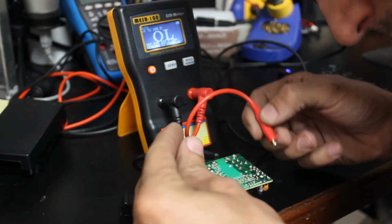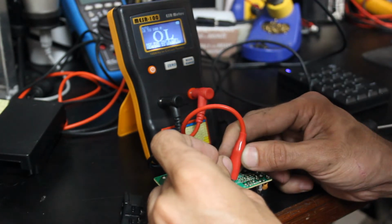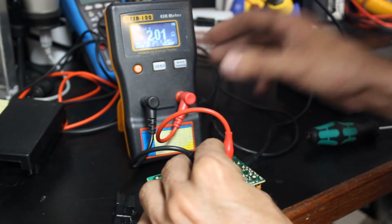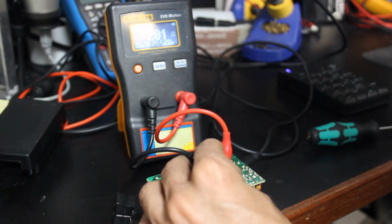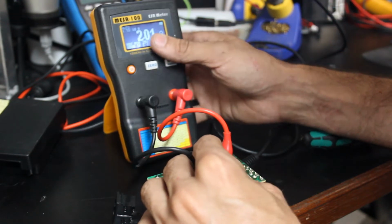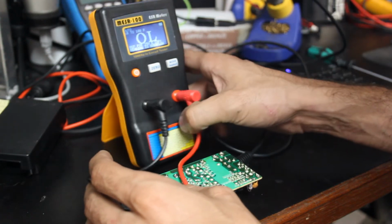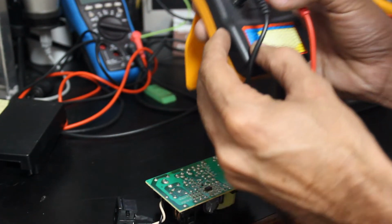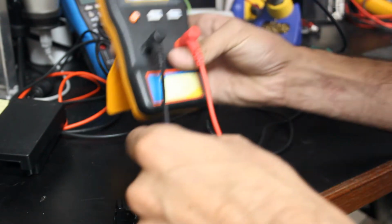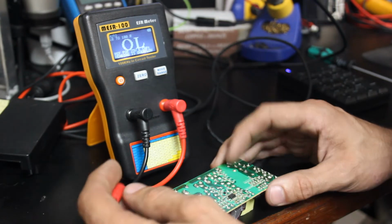Okay, so this is going to be that 47 mic. Let's see if we can grab it. Ooh, 2 ohms. That's kind of high to me. I think we'll go ahead and replace that. Let's check the little chart just to see. Yeah, even the chart says 1.2 should be about what it needs to be, and it's way worse than that.